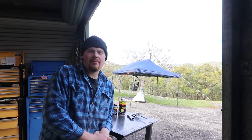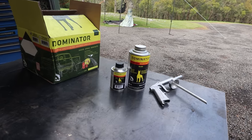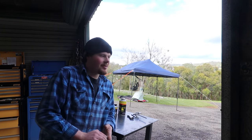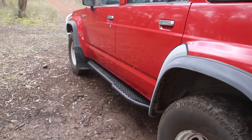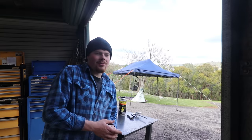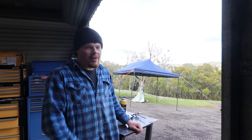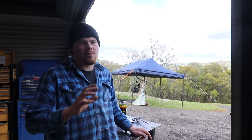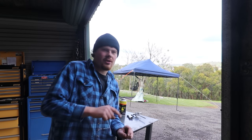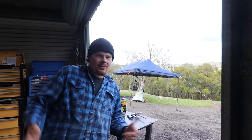The bar's back from being sandblasted and primed — it's ready to go ahead and paint. As I mentioned, I'm going to be spraying it with Dominator, same as I did the rock sliders, so it should all blend in. I really do like the black and red contrast. It's held up really well on the rock sliders and I like the finish — it's a ripple slash splatter finish, but it stays super glossy, which means nothing really sticks to it, which is good when you're living on dirt roads. I've gone ahead and run a bit of seam sealer over some spots where I'd stitch-welded plates, just to stop any water getting in later and causing rust, and also just to make things look neat. That's cured. Next step is to run over everything with a bit of Scotch-Brite, wax and grease remover, and then we're ready to spray.